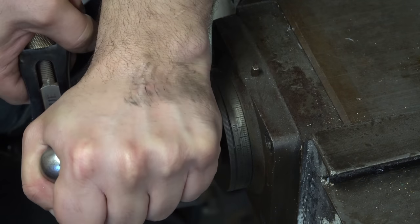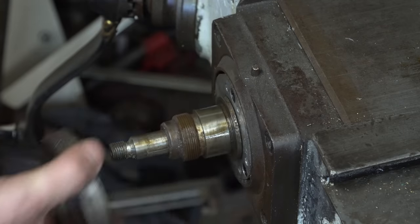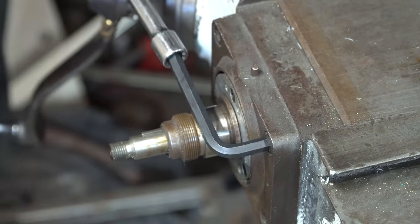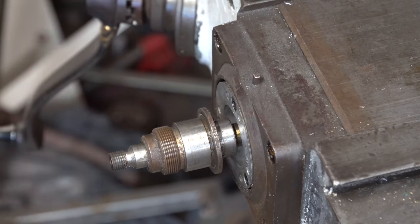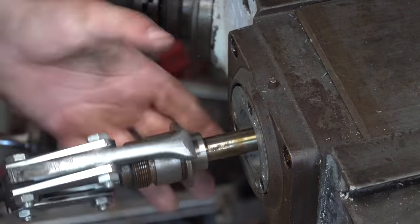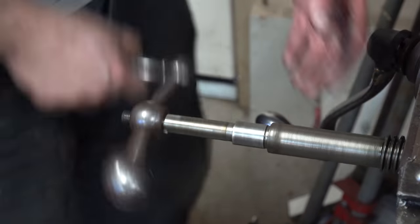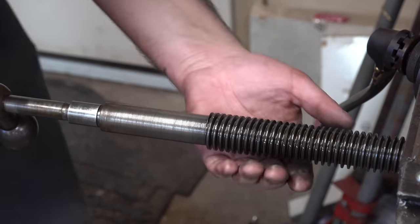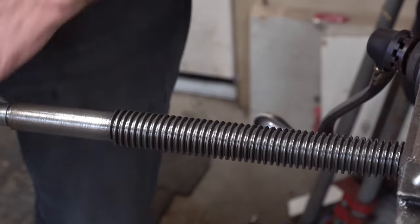This is the other axis I'm finally taking apart. It has a lead screw attached that's much shorter than the other axis, but this part was actually kind of stuck on. I had to use the dreaded chisel method to pry this off. It's not the end of the world — after I got a certain distance I can get a gear puller on it and pop it right off. With that removed, I can unscrew the lead screw on this axis. I'll assess whether it needs to be fully replaced due to massive wear damage, but it does look sufficient.